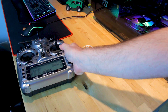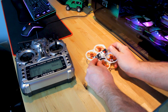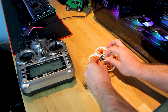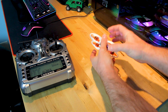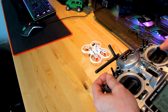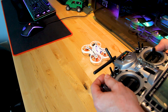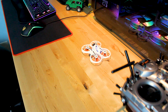I just flashed the firmware for the ESCs — the speed controls. I updated them to version 16.7. They came with 16.6 and now other things should work. One thing that did not work initially was the D-Shot beeper. Now, as you can see, it's beeping. Fantastic. I tried all kinds of things and I couldn't get the beeper to work, and it turns out it was just an older version of the firmware on the ESCs.